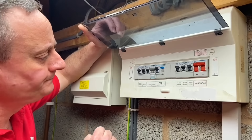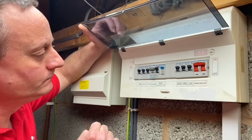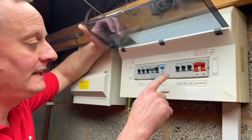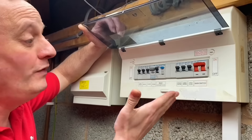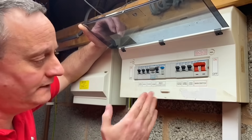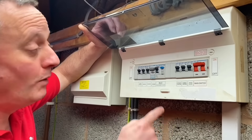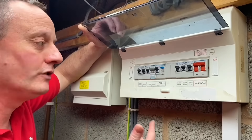Well, that is certainly an option; however, there are one or two challenges with coming off the main switch side in this case. I've got to make sure I get exactly the same Hager breaker that's already installed here. If I find one that fits but isn't the same manufacturer, it won't have been type tested to be installed within this board and can cause issues with thermal constraints, underperform, or cause issues to the breaker it sits next to — so that's not a good idea.